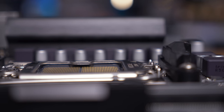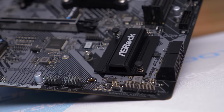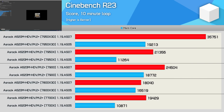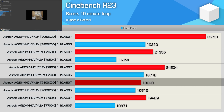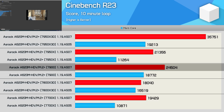By this point I'd now wasted three days testing this thing and the data was largely irrelevant. The good news though is that after all of this, ASRock did manage to fix the board - at least for 65W, 105W, and 120W processors - while officially removing support for 170W models, though the board will still boot with those models installed. Here's a look at how the A620 board behaves with both BIOS revisions in Cinebench R23's 10-minute loop test. The original AS05 BIOS was very broken, and with the fixed version the 7700X was almost 80% faster. With the latest BIOS, the 7800X3D and 7700X are now performing as they should, delivering comparable performance on the A620 board to that of B650 and even X670 models. The same is also true for the Ryzen 9 7900, which saw a 31% increase with the new BIOS, boosting the score to 24,504 points.